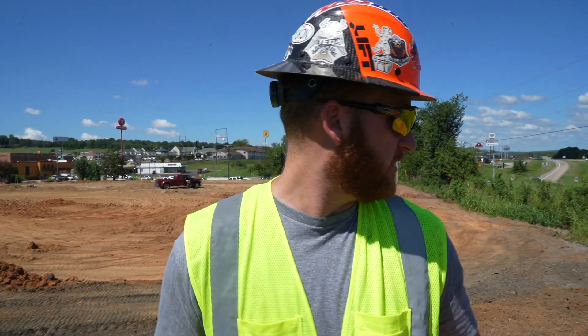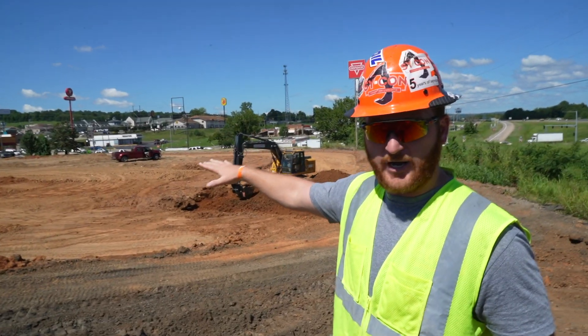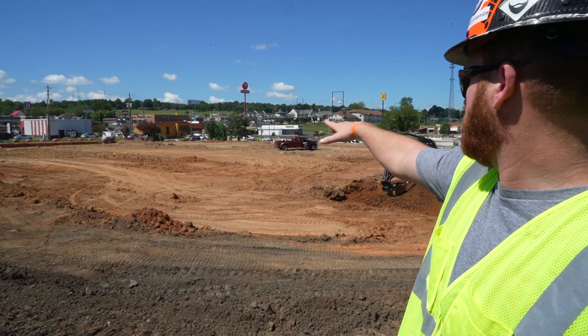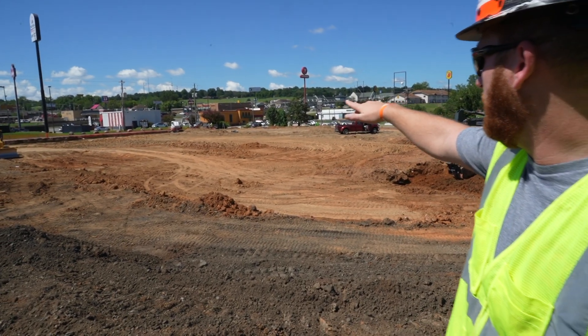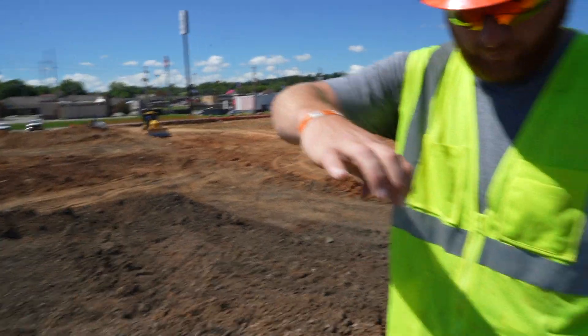We haven't really talked about Whataburgers much — we've actually picked up a client that is building a few through our local area. It's about an hour and a half from us, and we've got another site about another 45 minutes further from the shop. You can see Bill behind me — we've got a couple of spots that failed proof roll this morning. You can see the building pad up there; they're just south of that red dually and they've got concrete footers going in.